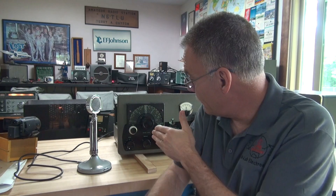I popped the cover off the side of the VFO — and luckily on the 500 it's pretty accessible versus a Ranger or a Valiant. The first thing I spotted was that notorious 18K resistor; it was the old one and it measured about 22K, so I went ahead and swapped it out. But I also noticed that the 6AU6 oscillator tube wasn't lit. I reached in there and rocked it — here she comes. Flipped that function switch to zero, looked over, and up comes the drive current. I was able to adjust the drive for normal operation, and now I have full output from the Johnson 500.